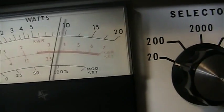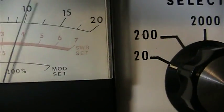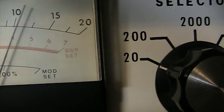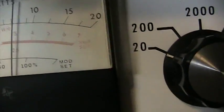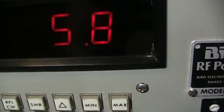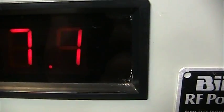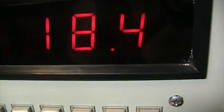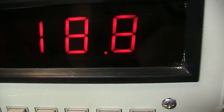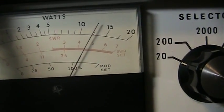On a whistle it looks like about 12, maybe 15 watts at peak. So surely if the Dosy is doing 15, the Bird's going to be doing like 10, right? Let's see — on peak: 5.8 dead key, swinging to 19 on audio. Imagine that — the Bird is showing more peak watts than the Dosy!